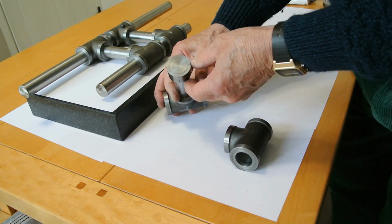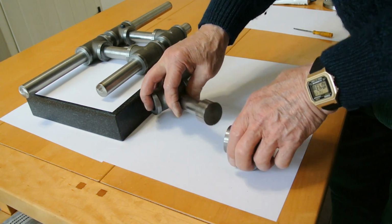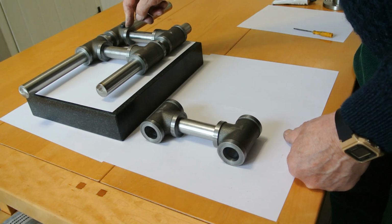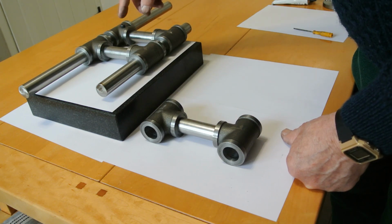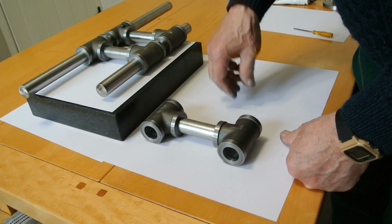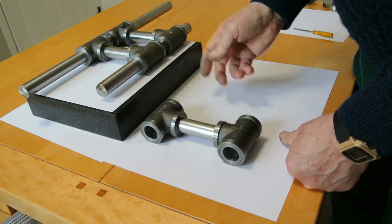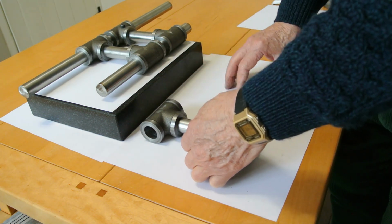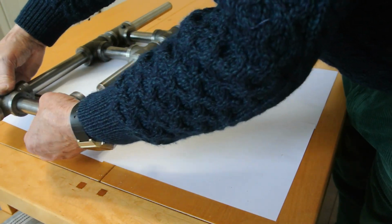And what I did was, you can probably just pick out, there's 4 hacksaw slits at each quarter. And when I was doing the very first one, I only had one. First of all, I had no slits and I couldn't squeeze it up. So I put one slit in while it was glued, while I got the glue in, and that solved the problem, sort of, but I could see the glue was only oozing around this point, and it would have been better if I'd had each quarter separately. So when I put this together now, I shall be able to get around that problem, so people can benefit from my experience of doing this, if anybody chooses to have a go at making this.